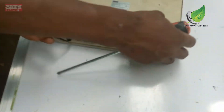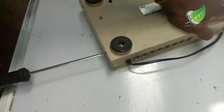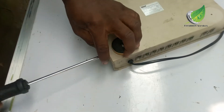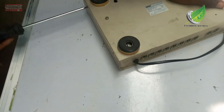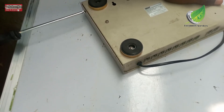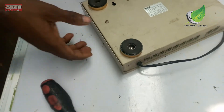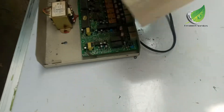To remove this PABX I have screws on the side which I'm going to remove right now so I can get access to the main board. The areas I'm going to be testing are: the transformer, to make sure it still supplies the right voltage to the motherboard; and the capacitors, to make sure they're okay — if they're swollen that indicates the proper voltage won't be supplied. I'll also be checking the chips.